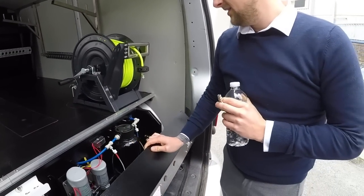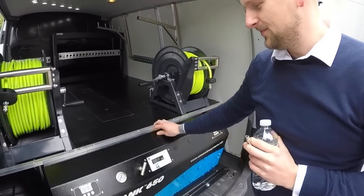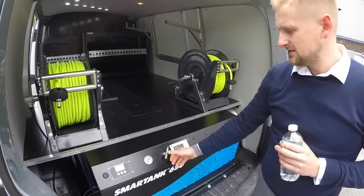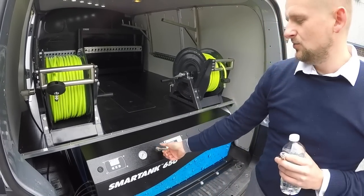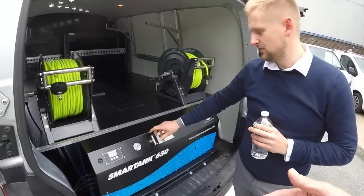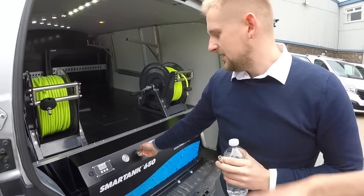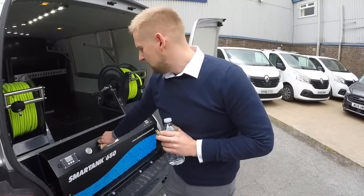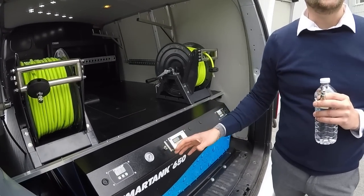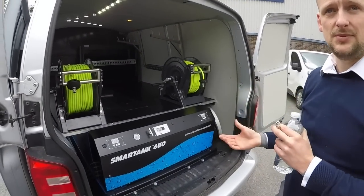It's just loose resin, so it's a nice simple change. This little chrome fitting adjusts the membrane flow. When you want to flush your membrane - recommend doing it every fill, or every couple of fills - completely flush your membrane for 10 minutes. Wind this out, put your garden hose or outdoor tap in and let that flow for 10-15 minutes to flush the membrane. Try to do it every day if you can; every couple of days is also fine. Screw that fully in, then one to two and a half turns - that should be the perfect ratio for getting your pure water and your waste water, around 30% pure to 70% waste.